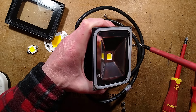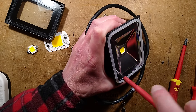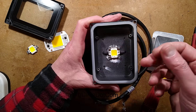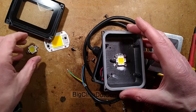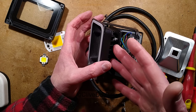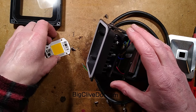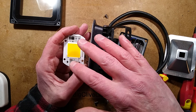I know what's in here — it's one of these little LEDs. But look at all the complexity compared to the modern version. Another good thing about this construction is plenty of heat sink compound, still sticky as well. All four screws are present, which is quite nice. It's a high-power LED with a dedicated power supply. See how the heat sink fins in the back are dissipating the heat directly from the LED, with a spacer so the wires pass through channels, keeping the power supply thermally separate from the LED.